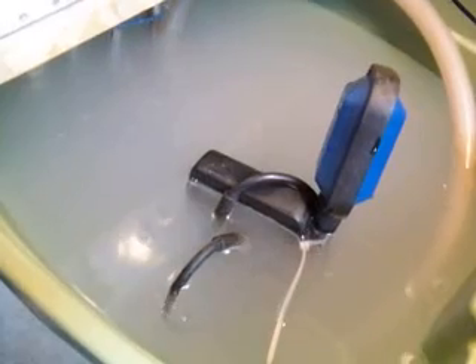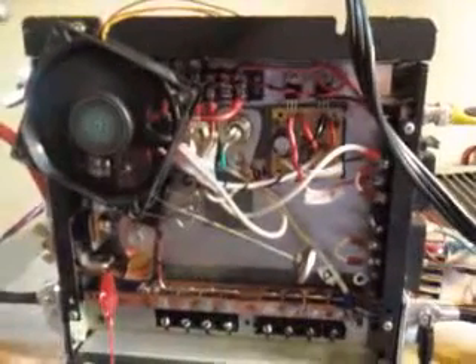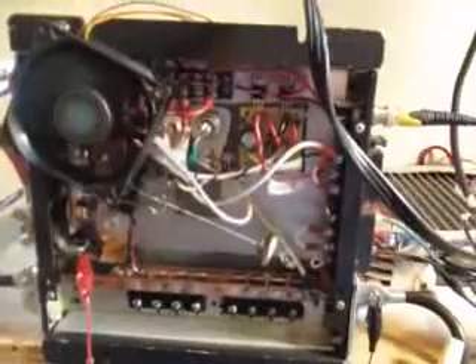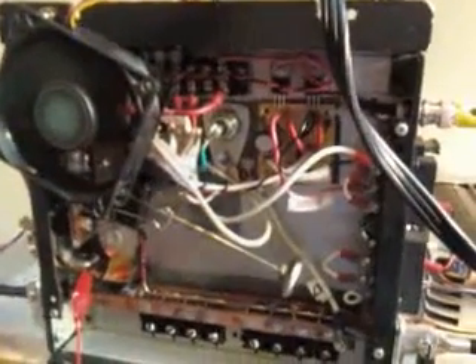What we've got going on as far as the cells go — there's the cells here. We've got a pressure gauge, it's about 7 psi from the sump pump. We also have the PWM MOSFET switcher powered by a function generator. Four of these cells are powered by the variable power supply, running about 30 volts DC. Then we hit the last cell in series with the MOSFET switcher, pumping about 13 volts into the last cell.